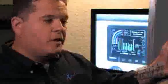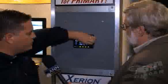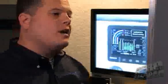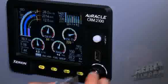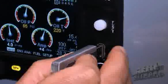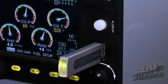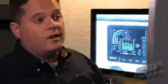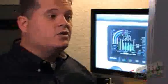As far as the configuration goes, there's a USB port on the side here which allows our installers to configure it for the aircraft at that time. We've got a process that is very simple — inserting the USB drive will upload the operational parameters and configure this unit for that aircraft's tail number and type-certificated requirements on the spot. It can also receive updates if the owner upgrades his engine or has any other requirements that would affect engine parameters. We can just send them a new update file that they can download, and there's no additional work that has to be done.